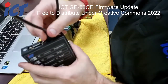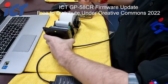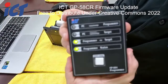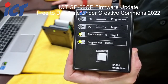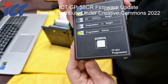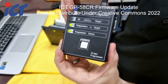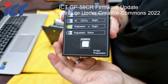Connect the included RJ45 cable to the port on the programmer, then plug it into the back of your printer. That will restart the printer and illuminate some LEDs on the FP001. We want to see lights L3 and L4 — L4 will be flashing. If you haven't changed your mode, it will reflect which mode you're in. If you're in L1, switch over to L3 and that will update the lights. Once you're in L3 and your L4 light is flashing, your printer and programmer are both ready to start the process.